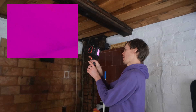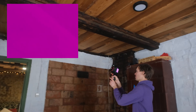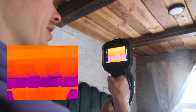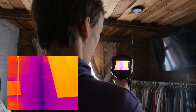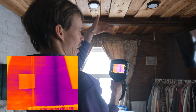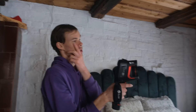Let's check out this spot here — I know there's no insulation up there but it's actually holding up better than the living room spot with insulation. The coldest spot is only 15.5 degrees, which is quite incredible for having only one sheet of insulation, unlike here which has four sheets. At the end you can see some very cold parts because that is the outside wall going straight out — 11 to 10 degrees. The corner of the bricks is also the coldest because they end quite solid, so cold comes through the corners. This could only be solved with external insulation all around the house.